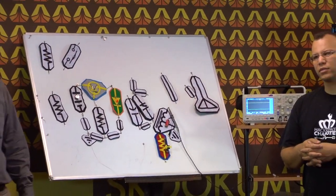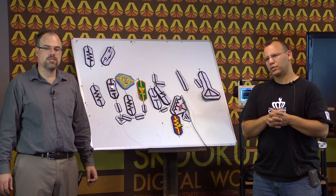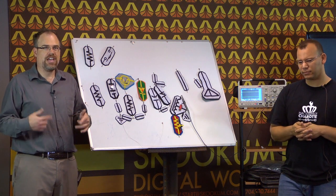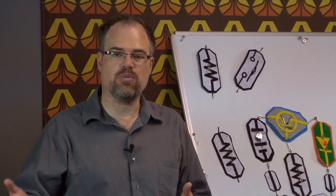What do you mean? Well, if your inductor was able to handle a greater amount of current, what could you do with that? Instead of having, or are you needing the inverse of that? You really need amplification in order to create a self-driving oscillation. Because it's feeding back on itself? Yeah, because the signal out will never be greater than the signal in. There's always loss going through this. So it's feeding from the inductor back through the transistor, right.